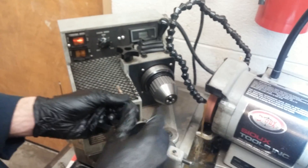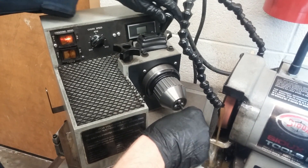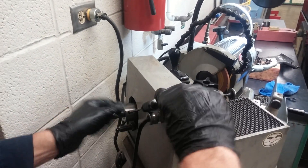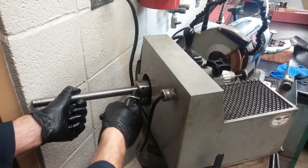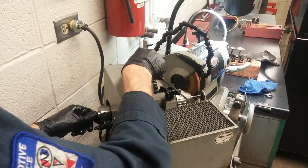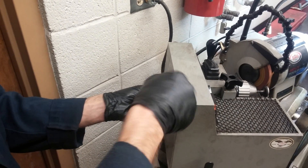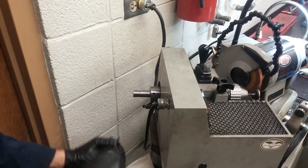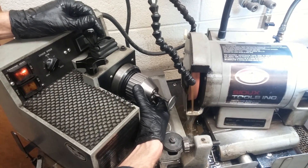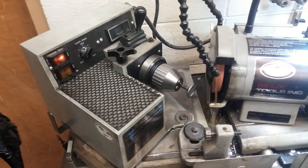So now we come over here and put this inside. This is already set up pretty closely to where we want it. But if you come around the back side, there's a rod, and on the end of that rod is a cone. That cone fits into the chamfer on the valve and it ends up being the depth setting for the valve. I put the valve where I want it, push that cone into it, and tighten that down — that's our depth setting. You only have to do this on the first valve. Then I release the chuck, push the valve in, make sure it's centered into the cone in the back, and lock it down.